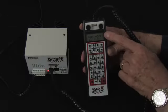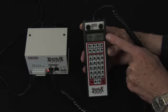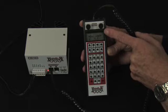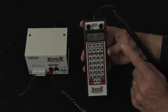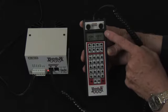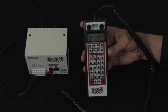If you want it to blink, you simply press the Y plus key while the words plus on, minus off are in the display, and you can see it blinking. That puts the DB150 in a pause mode for certain diagnostics that we can perform with the system. But for all practical purposes, we always want this small black dot to be on solid and never blinking. If it's blinking, simply press the Y plus key again, and note that the dot changes from blinking to solid.